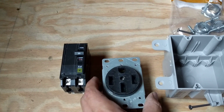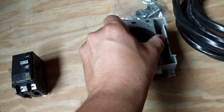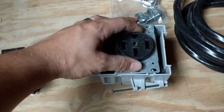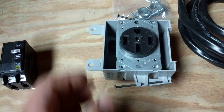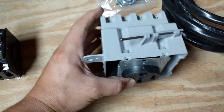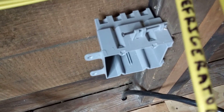That is what you're going to need. Once this box is mounted in the wall, the receptacle will just sit right over the top like that. Then you have a cover plate that goes directly over that, just like your standard receptacle. This is going to be mounted to the side of the stud, just like I have this one here mounted, and it's just going to be cut out around it with the sheetrock.